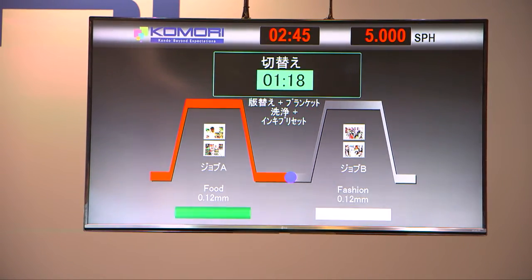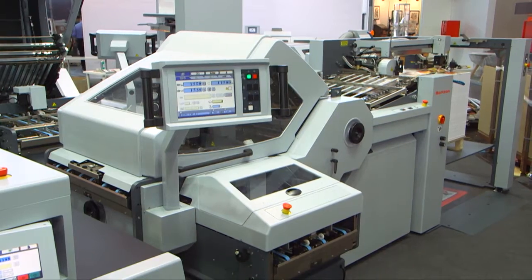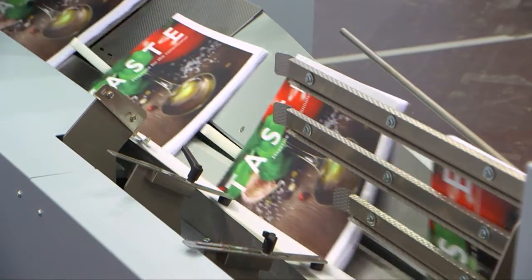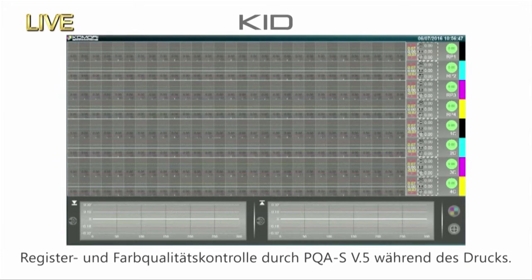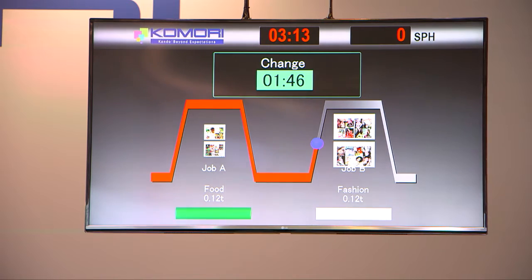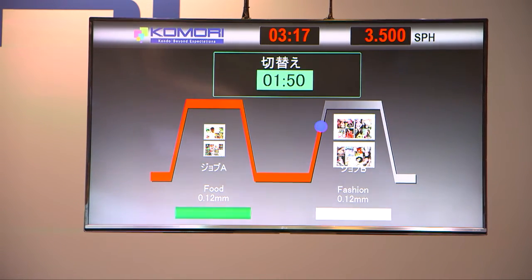The finishing information for the 16-page A4 brochure printed in the first job has been sent to the Horizon workflow, and binding and cutting can be seen on the screen. Production will start in a moment and we're going to switch to the PQA screen. Take a very close look at the progress of the machine as it stabilises colour and maintains quality.